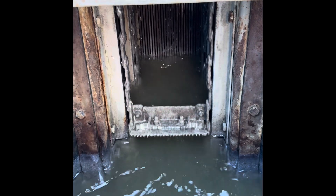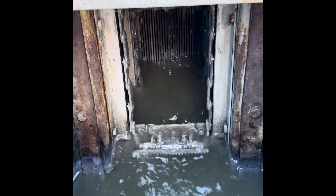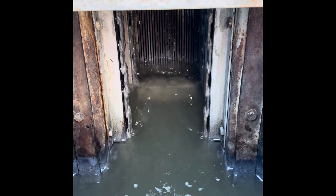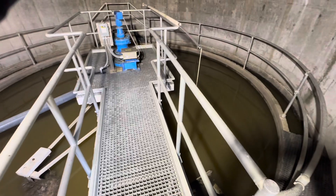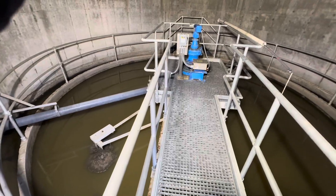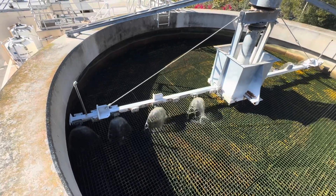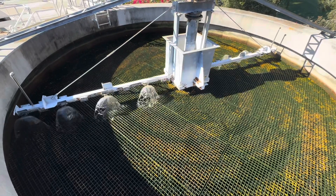Preliminary, primary, secondary, and tertiary are all forms of wastewater treatment. Preliminary and primary are mostly physical — screening out large debris and settling out easy-to-settle solids using gravity to lower the BOD loading on the biological secondary treatment. Secondary treatment is biological, where we have engineered media full of naturally occurring bacteria that consume waste into one location where we can take care of it and move it out into the environment. Anything beyond secondary treatment is considered tertiary and can be chemical, biological, or physical depending on what you are trying to accomplish.